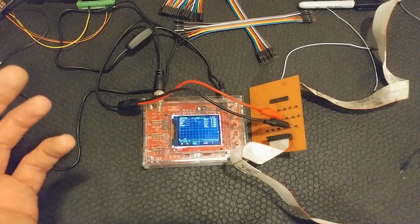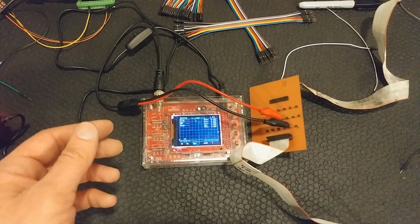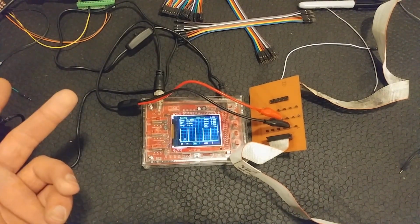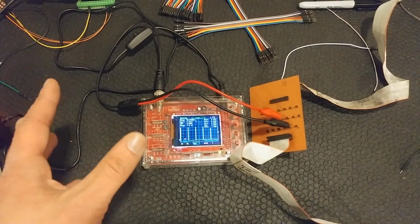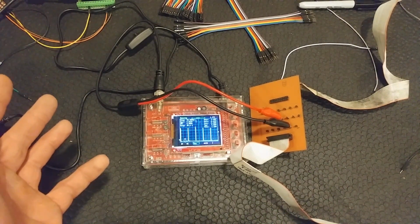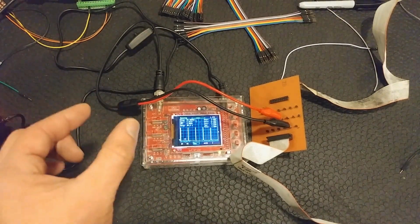And eventually, I found this one that seems pretty interesting. So, starting the motor up, now at half a mile an hour, we got this little guy, another square wave, but a pretty low duty cycle. It's varying between like, I don't know, 0.5 and 45 on the duty cycle reading here. Again, not very stable because it's a very thin waveform.